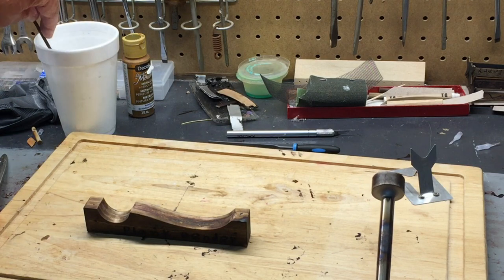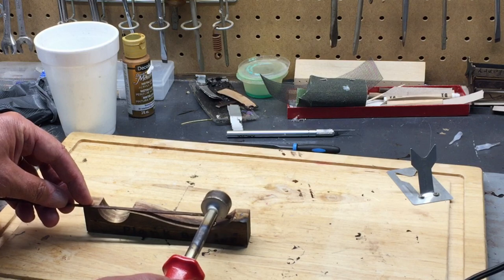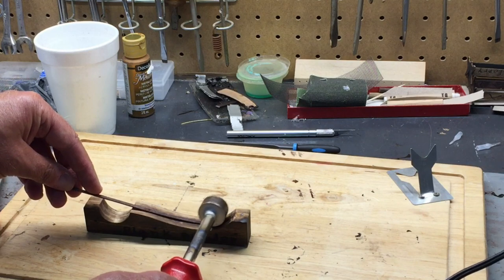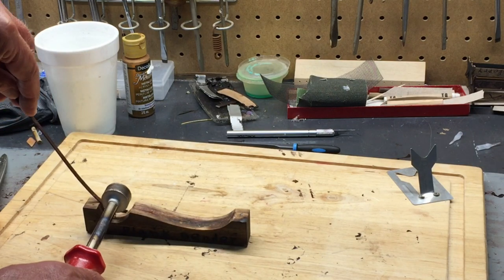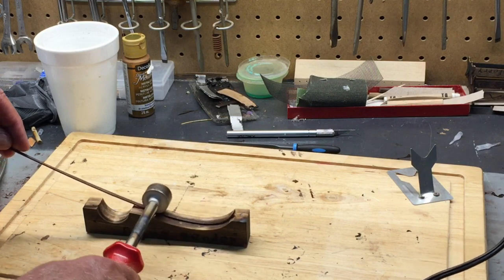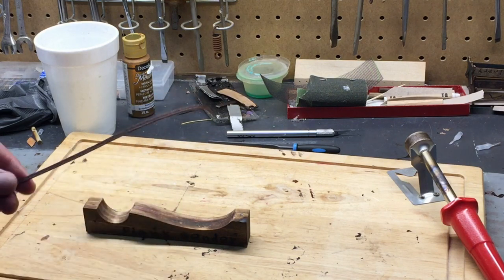I've determined on these, all I need to do is dip in water the part that I want to bend, because this wood is porous and thin, and then I can just go ahead and bend it without really soaking it. You can see that slowly start to bend to shape. This is a pretty tight bend — I even put in a little bit on this side to get it just a little tighter. Wherever it was wet, I just run over it to get rid of the moisture, because I don't want it to swell. And that's pretty close to the shape that I need, so I'll put it on and we'll go from there.